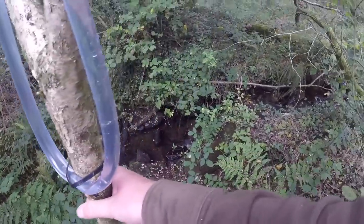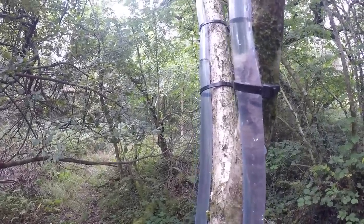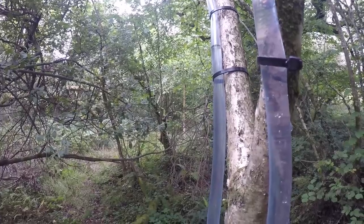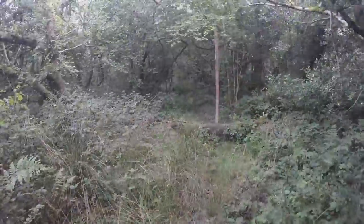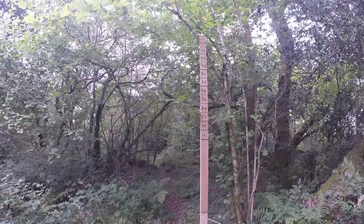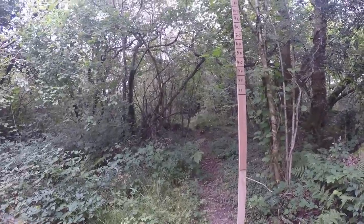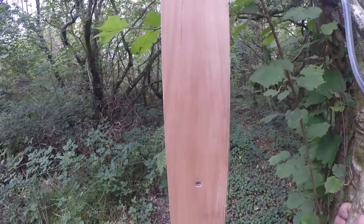So, sticks at the height of the source. Now we're going to sight down our levels. I'm not sure if you can see the post over there or the numbers on it. So in the level, that is a meter. So we're at 1 meter. A fighter jet just flew over. Now I'm going to come to the spot where the stick is standing, and that'll be the point from which I now use the water level. I'll hop that along to another point over there and tally up on my phone, keeping a note of how many meters it is. I have a feeling it's going to be more than I thought. I thought it was about 10, but if that's a meter already, it's more like 15 or 20, so that's excellent news.